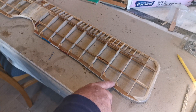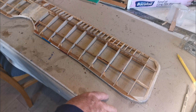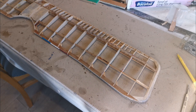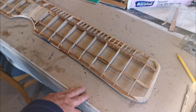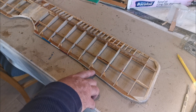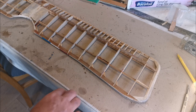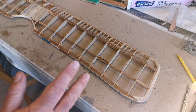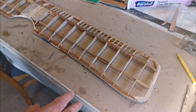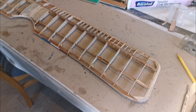Of course removing the trailing edge will involve removing some of the rib, and I think these braces will have to go. What I'm going to do is replace this trailing edge, not with spruce, but with a hard balsa that I have which will actually be thicker - and I'll let in the positions of the ribs into the balsa. I haven't got any spruce handy, and if I cut this off I'll be left with a very small area to glue to. However, if I make the trailing edge wider and out of balsa, I can let it in and get a lot of the strength back. So I'll pin down where I can on the board, get this as flat as possible - there are a few damaged riblets but they can be replaced - then remove this trailing edge and we'll see where we are.